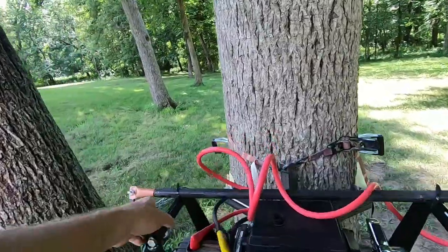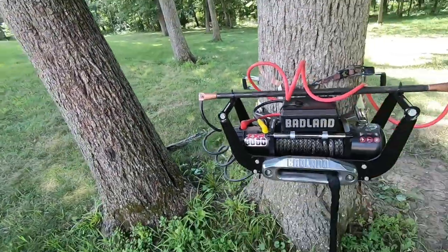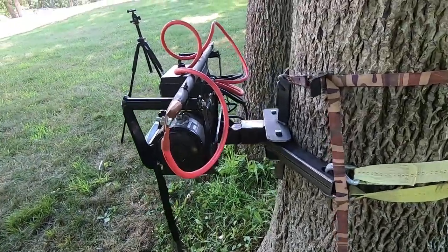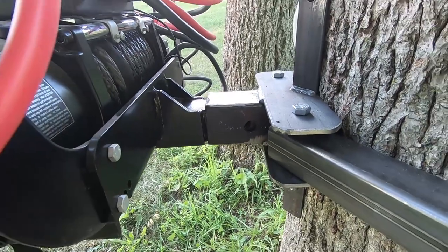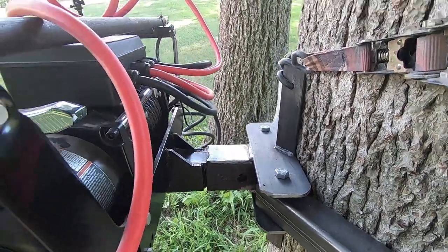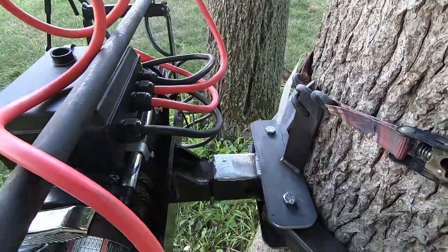It was definitely a good idea drilling those holes — this would have been a challenge to do with these big straps without something hanging it on the tree. I'll cinch these up... it's on there. It's anchored on there good, straps are nice and tight. I do need to make one adjustment, unfortunately. I never took a measurement of this particular piece of two-and-a-half-inch tube to see if it would line up with my portable winch mount. My holes don't line up — I'm three-eighths of an inch off. If I knock a half-inch off the end of this tube with an angle grinder, that'll resolve it.